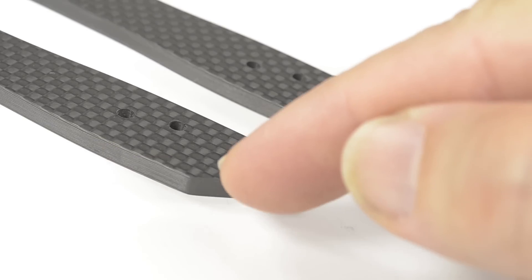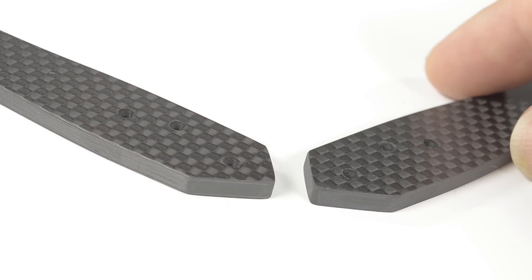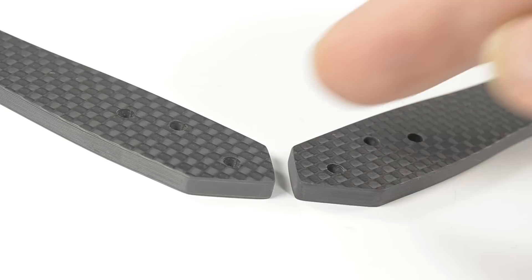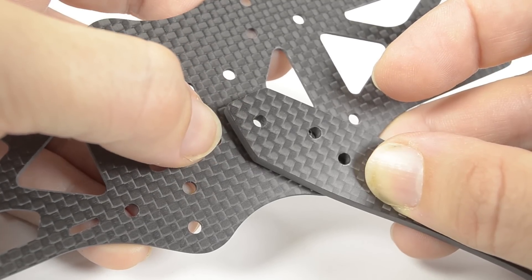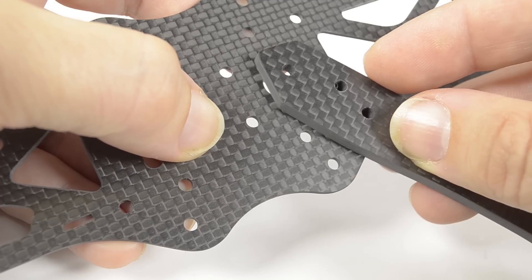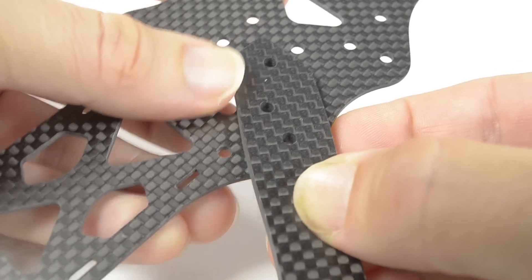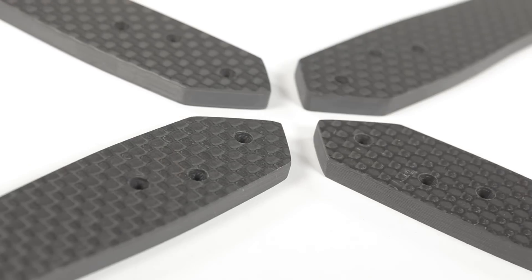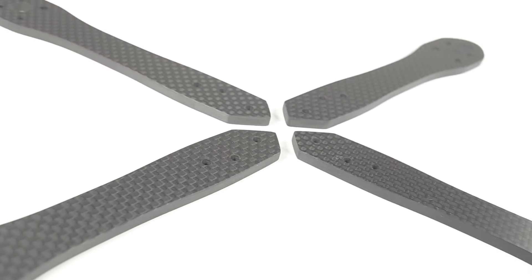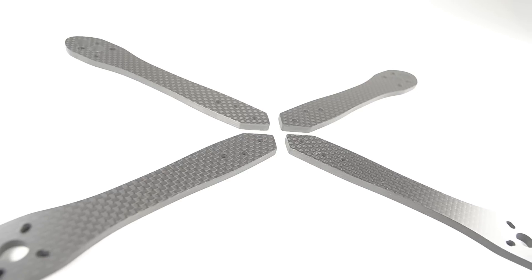The arms have a long and a short side in the center, and the same arm mirrors both sides. The long edge of the arm goes horizontally across the frame so the holes line up, then the arm flips 180 degrees to alternate around the frame. This is the way the arms key together in the middle to distribute force from one arm to all others in the frame.